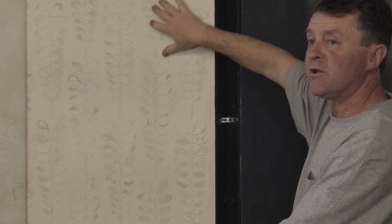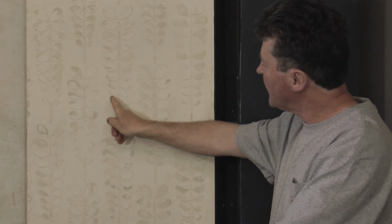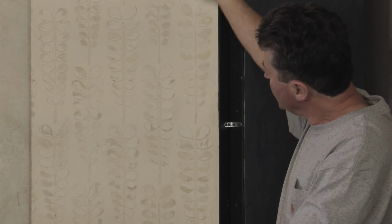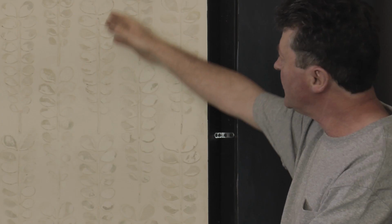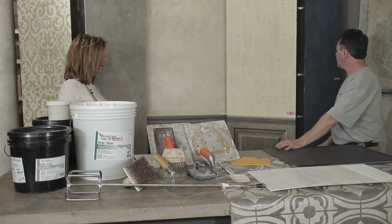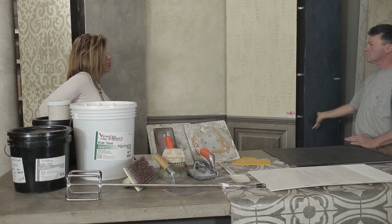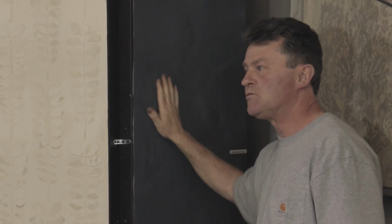Yes, and on this finish we used Piatto, and then for the backdrop of this stencil we thinned out Piatto in a grey and a certain yellow, and then after that we came back in with a cutting edge stencil and just hit and miss, so it gives that illusion of breakaway. And then this one was FirmoLux Milano Silver, tinted to a certain blue and smoothed out, so it has a really nice textural smooth feel.